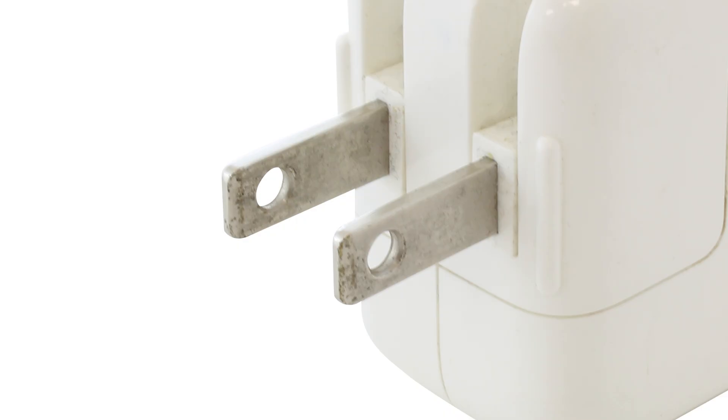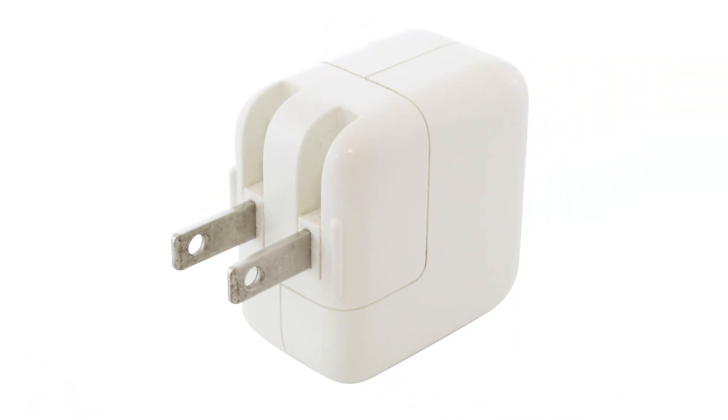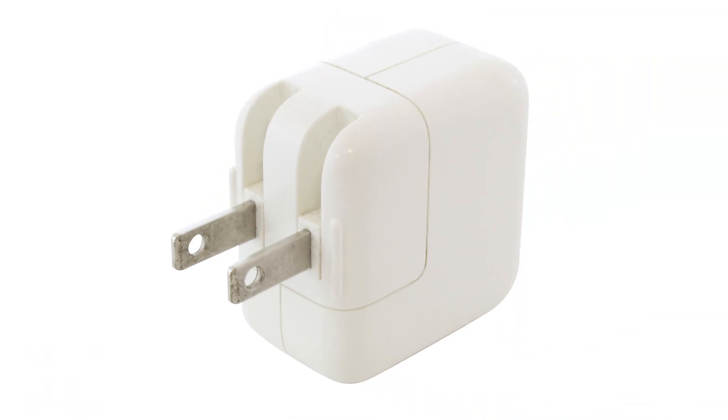We're not sure why people may want to do these things, but it seriously happens. These safeguards are put into place to ensure that your connections have the correct polarization and complete the full circle of electricity in a circuit. You may be wondering if non-polarized plugs still exist — and they do. If you have a two-prong plug with two equally sized pins, then it is not polarized. You may have noticed phone charger boxes have equally sized prongs; they don't need to be polarized because they don't provide a lot of power at once.